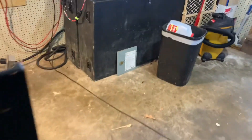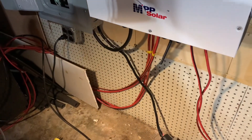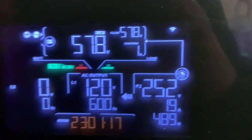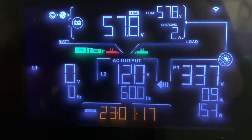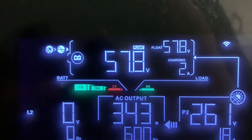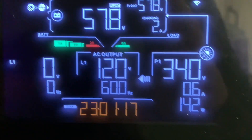So now we are officially up and running. We don't really need this light on, although it may come in handy in a bit. Here's our information — you can see the batteries still look good: 57.8 volts, which is full. They're floating, and that's with everything on.